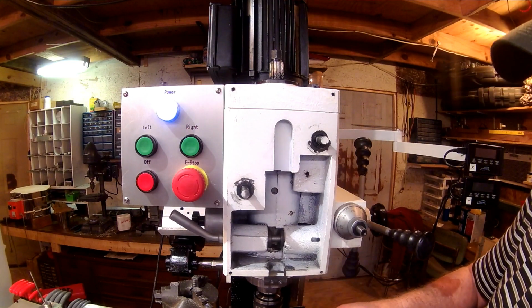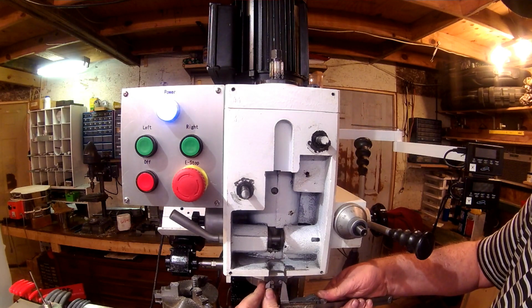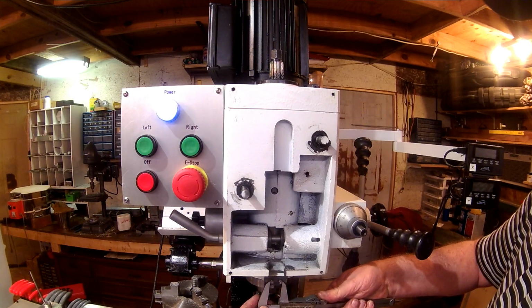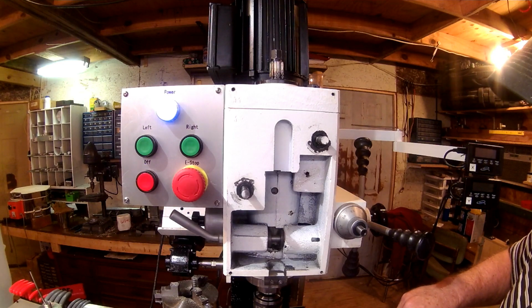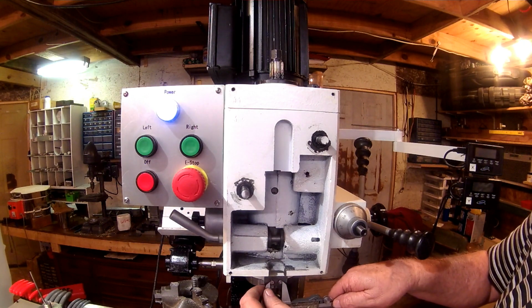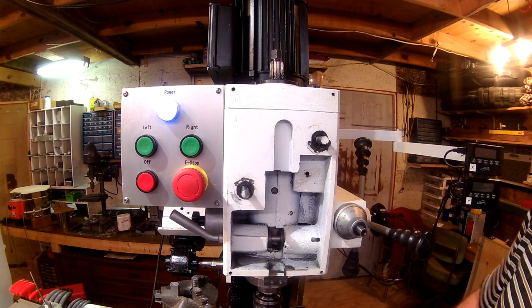Now, zero out our calipers. Now measure the distance from outside to outside. .470. I wonder what that would have been in millimeters. 12 millimeters. So that's the distance we want to find from the center. We'll divide that in half, and from the center here we'll drill our 2 holes in there to match that. I'll do that off camera and be back.